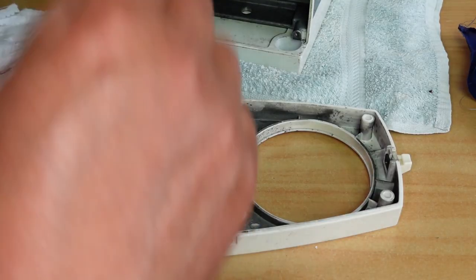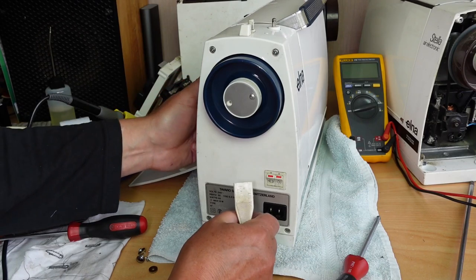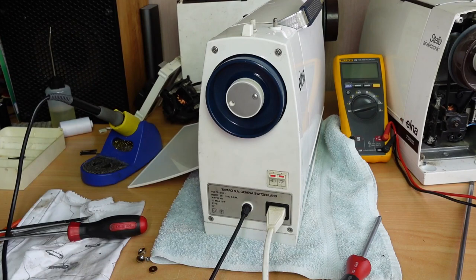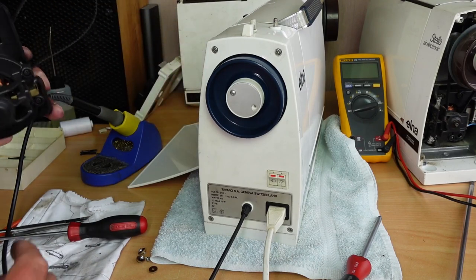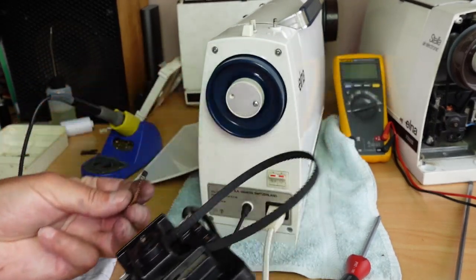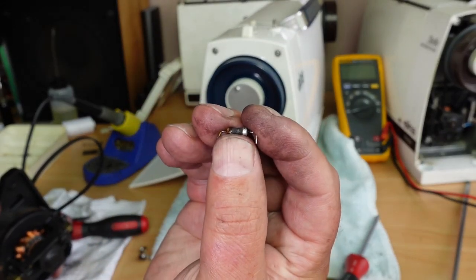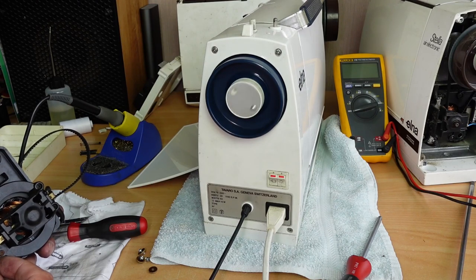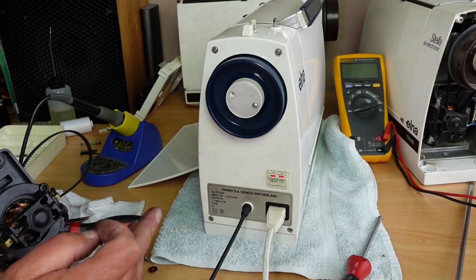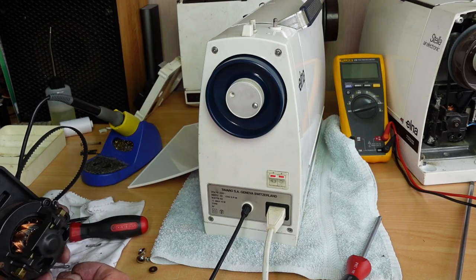Let's put the screws back in and then we'll be ready for a test here. Right, testing. Plug the foot controller in. Power. Yep. Nice. Okay, fixed. So that was a combination of problems there. The original motor had worn motor brushes. I fixed that, found it still had an issue, and traced that down to that nasty looking little resistor there. So yeah, running nicely there. So I'll have a happy customer because this machine has sentimental value for her, so she'll be pretty pleased, I think.